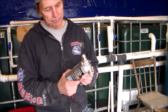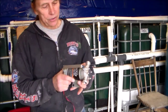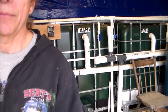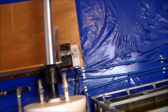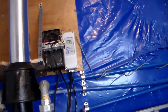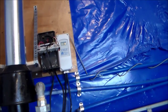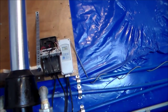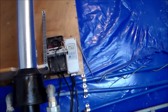My power supply was not handling the load and it kept blowing the rectifiers. What I did to improve the power supply — I mounted the rectifiers on an aluminum heat sink, which you can see right there in the middle. That's a quarter-inch aluminum plate with four rectifiers mounted on top. Operating at 25 amps with 12-amp diodes, even with the heat sink, it was pushing the limit and they were going to eventually go out.